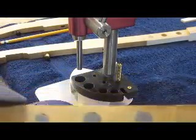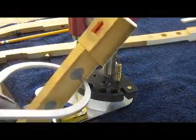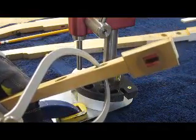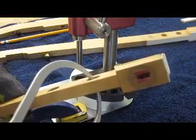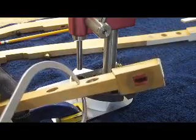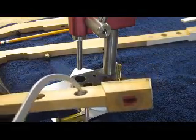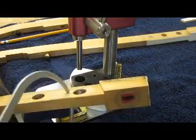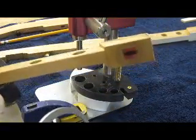However, if it's exposed from both sides, now these are already drilled out, so I can still make the point, though. If it's exposed from both sides, then you can set it in the usual way that you would use calipers like this. But the dimension you're going to get is what's left in the hole, not how much you have taken out of the hole. So the program shows you both dimensions, how much to leave and how much to drill out. However you're doing it, pay attention to do it the same way each time. Then you won't make a mistake. Okay?